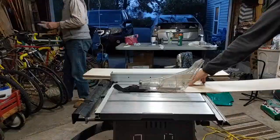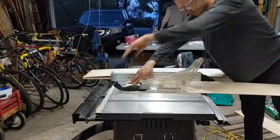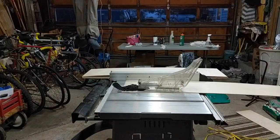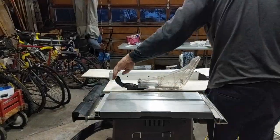These sheets of Baltic birch are 1/8 inch thick. If you stack them into a three-ply it'll have a good amount of bend and still be pretty firm, but if you do four-ply it'll be very stiff.